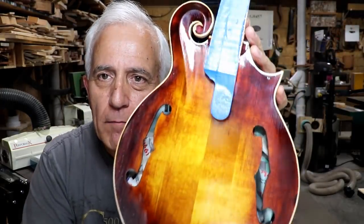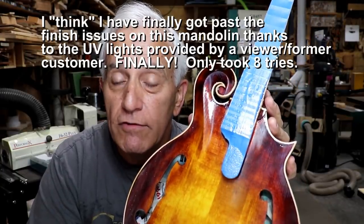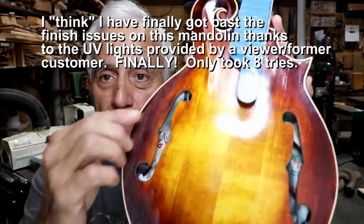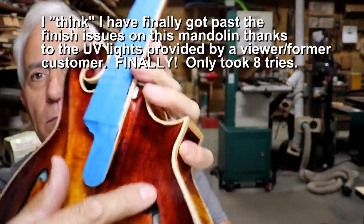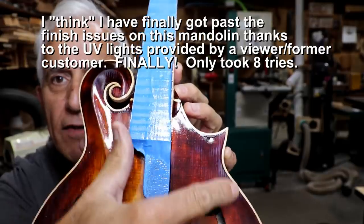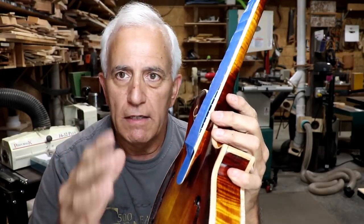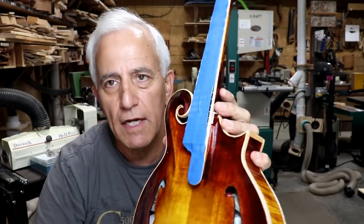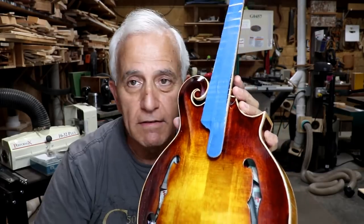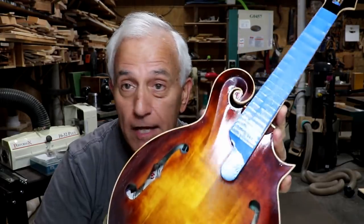Right now this doesn't look that bad, but it's driving me nuts. It's the old definition of insanity — you keep doing the same thing expecting a different result. I've put this finish on the front of this like six or seven times, and it's turning milky white in places right in there. It will not quit. It's getting less each time it seems like, but I can't get it to quit. I've put retarder in, I'm spraying it in air conditioning, trying everything I can think of. It just keeps driving me nuts.